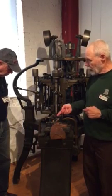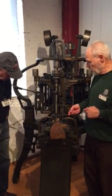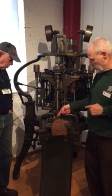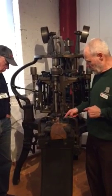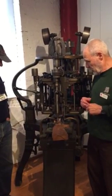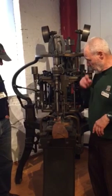These horns here are pipes. They blow air in there, cleaning this one out. If you have wood chips in here, it'll change the shape of the pattern, and it won't work. So you have to have something to blow that out.